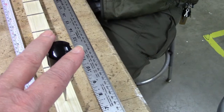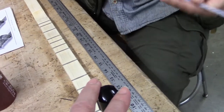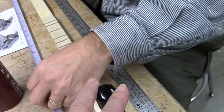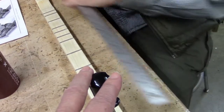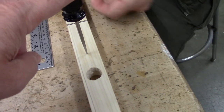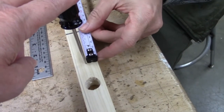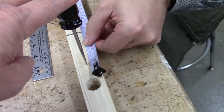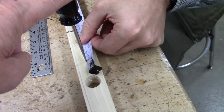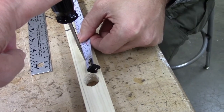So you could use whatever measuring device you have, but actually this one works well for that. If you use a tape measure, you might want to use something called burning an inch, because trying to figure out where exactly to put that hook, that could be an issue. So a lot of carpenters will put the 1 inch mark right there, and then they'll add an inch to their measurement. So we're supposed to be 24 5/8, so we want to go 25 5/8.